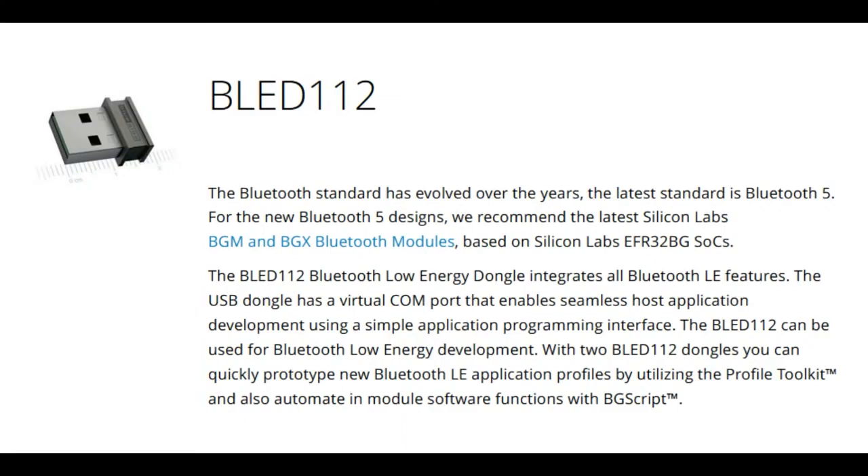One neat thing about this one is it's Bluetooth programmable. I remember seeing PLCs that were USB programmable, but this one actually uses a Bluetooth dongle — it's actually a Blue Giga — which means it connects over USB but presents itself as a COM port. That's really good because native USB is a real pain to program on every platform. By using basically UART to Bluetooth, it'll work under Windows 7, XP, 10, 11 — you don't have to worry about weird driver issues or native Bluetooth implementations. You're literally just sending UART data through the program they give you.